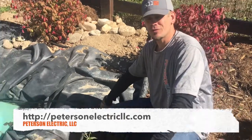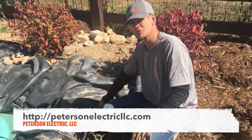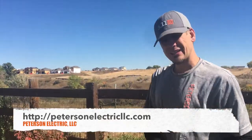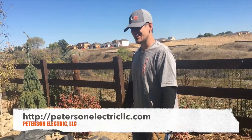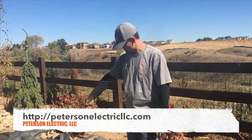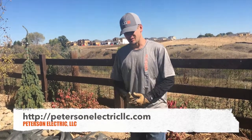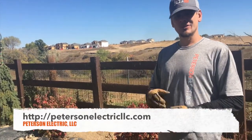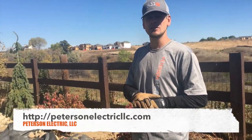Normally I don't like any landscaper or unlicensed person doing any underground electrical work — I'm pretty particular about it. But they ran a two-inch PVC schedule 40, which is good for a feed going to a house. They put a single run in two-inch, and I had to figure out how to adapt that. I wanted to put in a one-inch PVC, which would have been plenty — you can get a one-inch bell box and adapt right away, or go to an inch-and-a-quarter if you need a little more space.